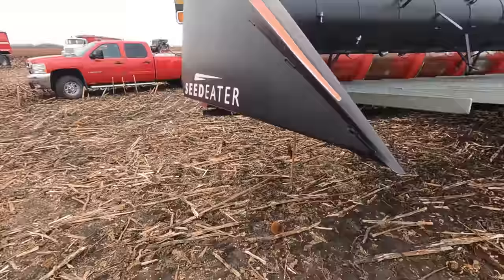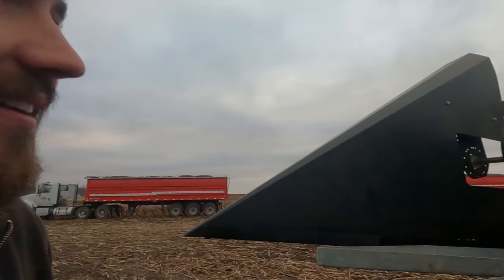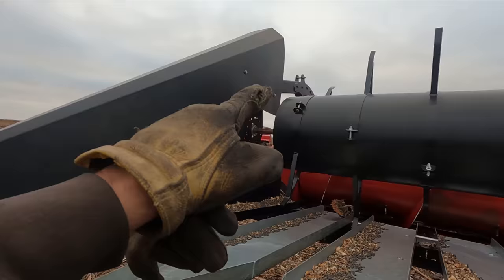We were running with this and I was going in the dark one night near the ditch, and I tickled some dirt with the point right here. Basically this whole divider just got sucked under the header. That happened because I saw this side had a little bit of a bounce to it — that side was more solid and I should have checked it out. But there was a bracket up there that was broken, so there was a little play in there. As soon as this touched the ground, boom, it just got sucked under.